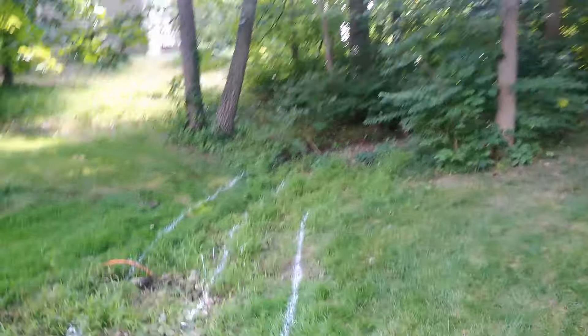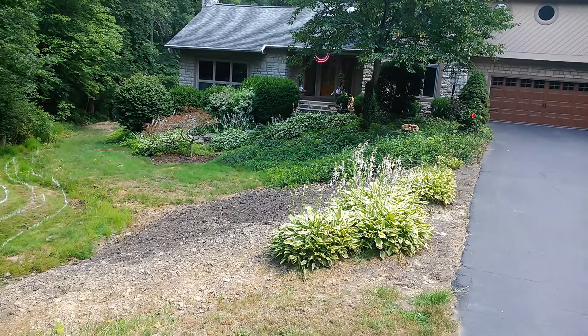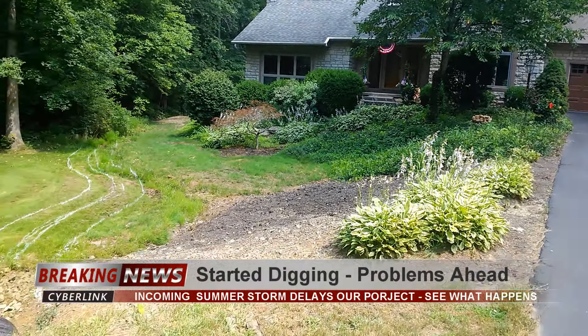As I dig this dirt out, I'll put it over here to raise the elevation — that helps funnel the water in that area. The same situation, though not as bad, is on this side of the driveway. Basically we're going to have a continual swale through this way, and a pipe will carry water under the driveway. In the future we'll take out some of this area — already partially cultivated — and that's going to become grass meandering from the top all the way down. For this year we're just going to clean up, prune, and mulch.